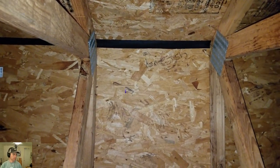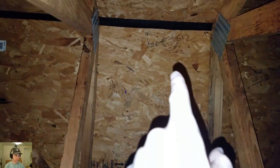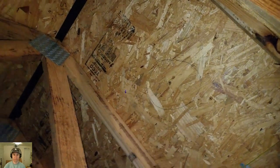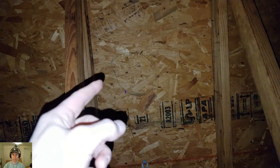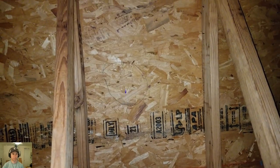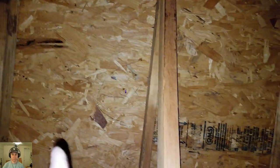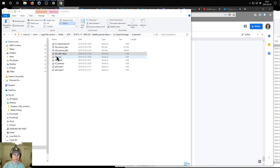Here in my attic, I'm figuring out where to put some panels. The tripod has three feet - one foot over here, one foot on the other side of that beam, and the third foot over here. I've marked generally where I think it's gonna be. I'm gonna get some plywood, attach it to these beams, and have a big bolt come through the roof with a washer on the other side of the plywood and some nuts - that's how I'll secure the tripod to the roof.